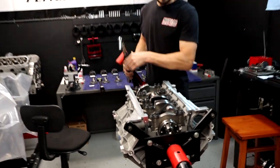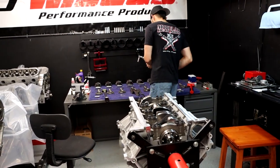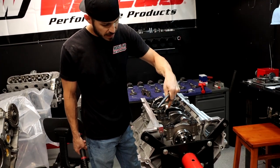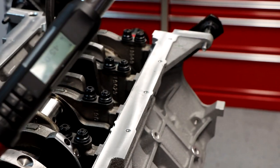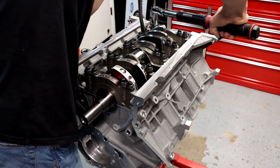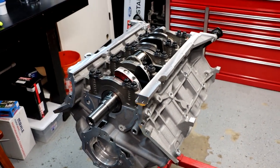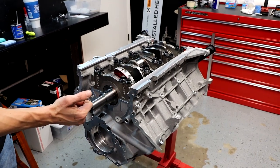In the case that my cap was too far forward to begin with, I'm just going to knock it back a little bit. Now I'm going to use my pry bar here between the counterweight and the cap and pull this forward — we're going to change camera angles so you can actually see how much this cap is going to move. Just a little positive pressure. Hopefully you guys saw how far that moved. Now I'm just going to snug this up. Now they should be in line with each other. I'm going to finish torquing them all the way, then put our magnetic base dial indicator right here on the cap and measure the travel on the crankshaft.